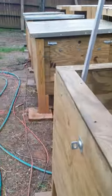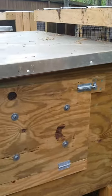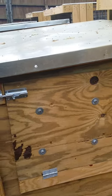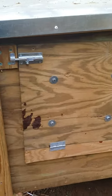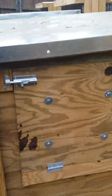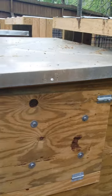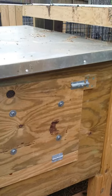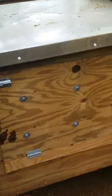Let me add one other point: you'll notice the side ventilation doors have latches on either end of the top. The reason is if you just had one in the middle, you're subject to warpage in that piece of plywood. So all four corners are secured and made to conform to the wall — secured on the bottom by hinges and on the top by latches. I hope this has been useful, and again if you have questions don't hesitate to contact me.